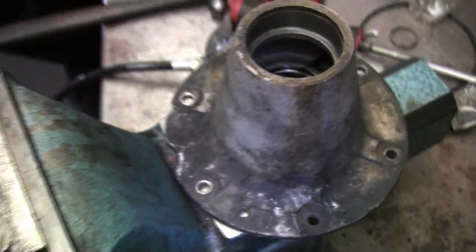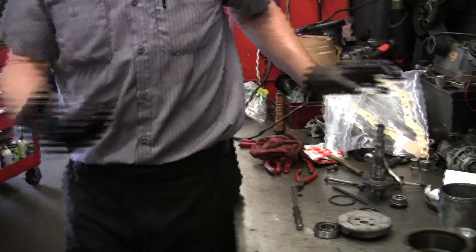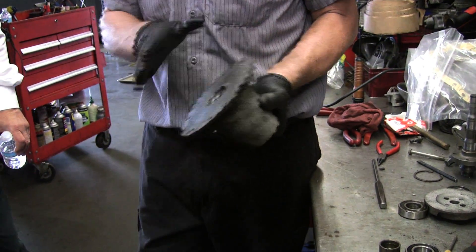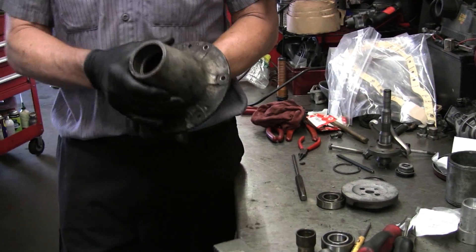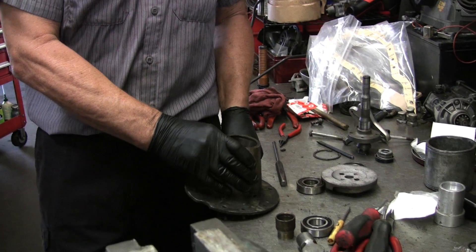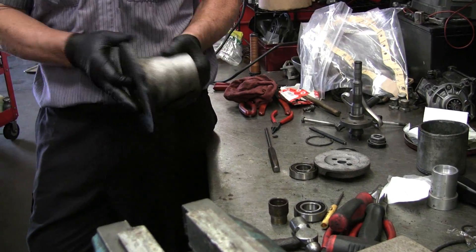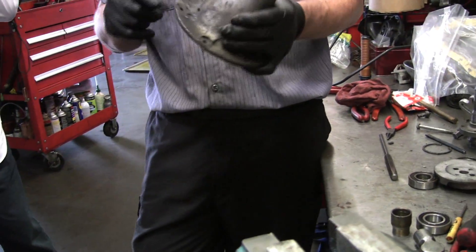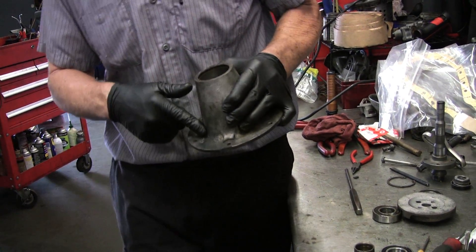Would it be wise to mark where the old bearing was when you took it apart, like a scratch? Well, it's pretty nasty in there — you can't really see. It floats. What holds this bearing in place is the snap ring on the shaft. You wouldn't put any sealant around the housing? No, because the seal is going to do the water sealing. This has actual air holes, and that's how you can tell when the seal is gone — it will leak out one of these holes, the bottom one usually.